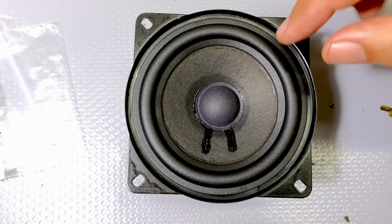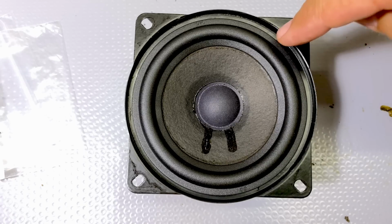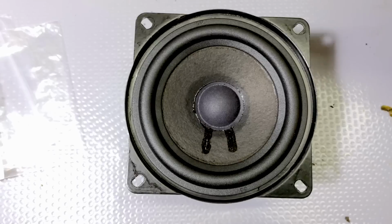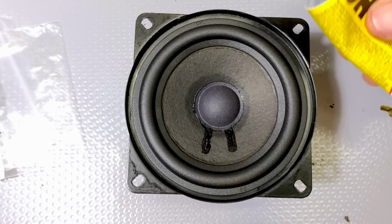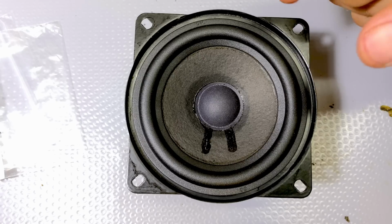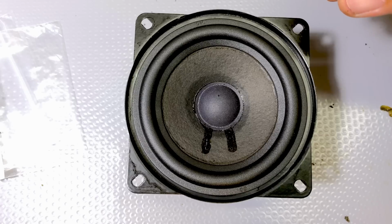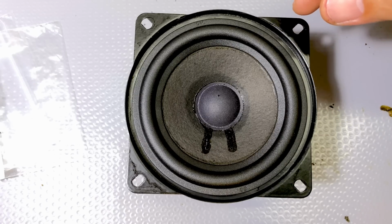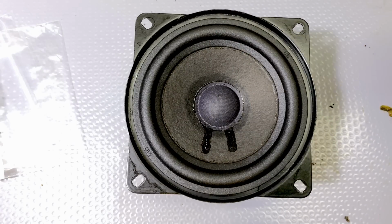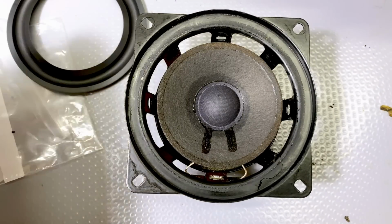You see, this would be the ideal because it is perfectly centered, but I need to make sure that I get this thing done right. I'm just going to use this normal contact adhesive. It doesn't dry straight away. It dries into a rubbery finish. It doesn't get hard enough to deform this. So I'm not sure. I think maybe I'll try the inner rim first. I can see where the last rim was, this foam is exactly the right one for this radio, so it's perfect. So I'm going to try that.